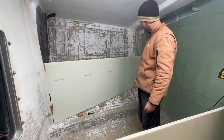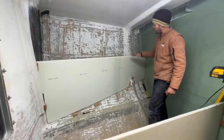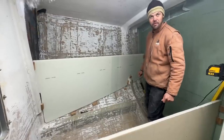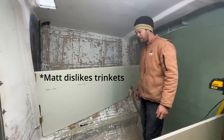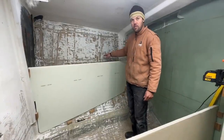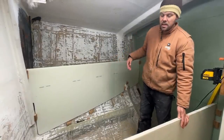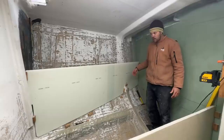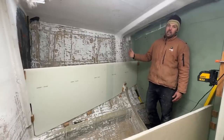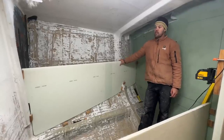Ta-da! Wow. Perfectly — like a puzzle piece. So this will be like a bookshelf on top, and then there'll be little cubbies in here that we can put trinkets in. The reason I'm doing this instead of just building a shelf off the wall is that this keeps the mattress away from the hull. In the past we've had problems with the hull getting cold while the interior is warmer, causing water to condense on it and getting the mattress wet, which causes mildew. This acts as mildew protection because it stays at the ambient temperature of the inside of the boat.